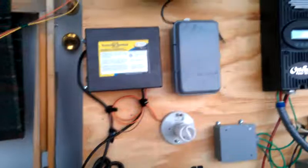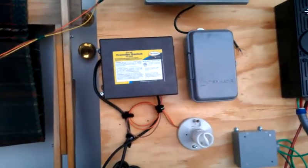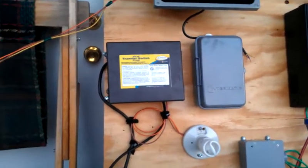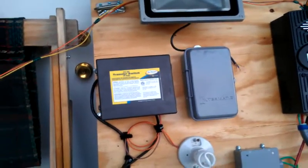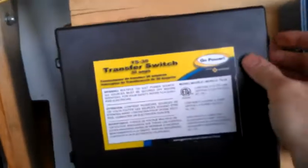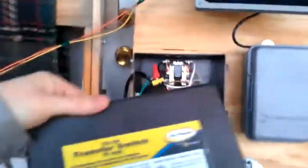What I've done is wired up the AC side — specifically the auto transfer switch, which is a really core component of my proof of concept. It's basically going to demonstrate that I can provide a couple of 15-amp circuits back-fed, with redundancy provided by utility. So I'll get this thing open. This thing was a $30 cheap unit on Amazon, made in China.